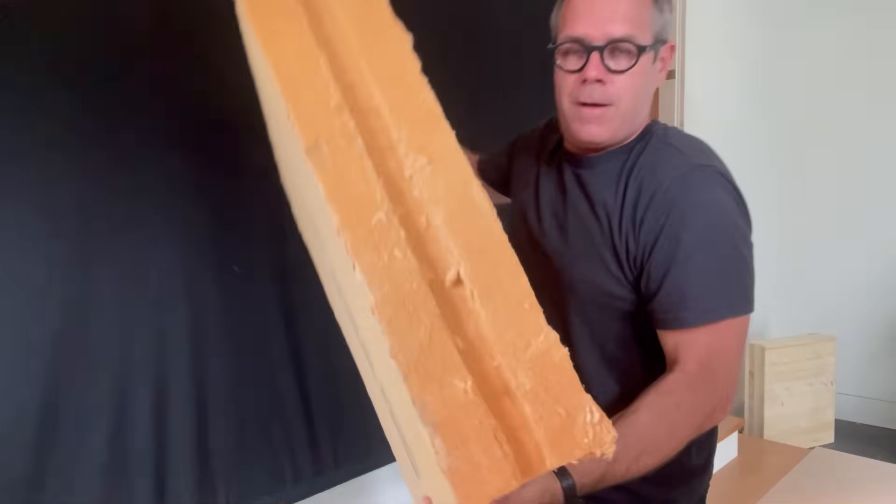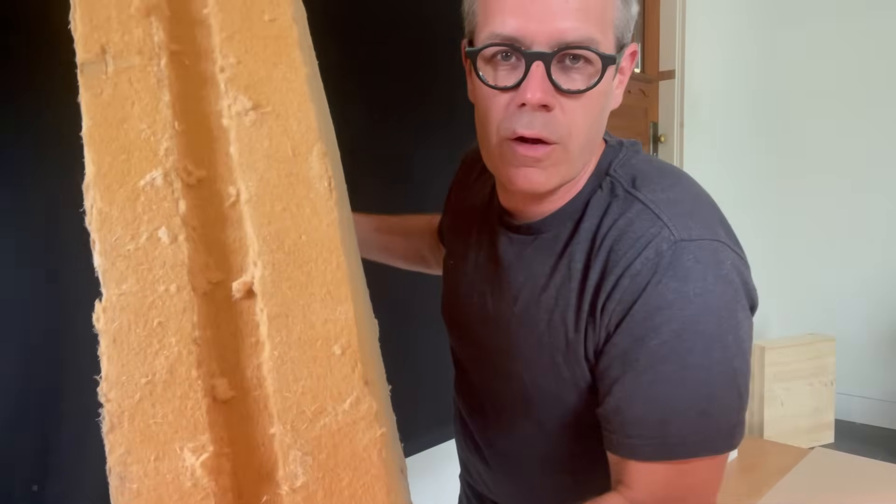You can also buy wood fiber board as a thin board — it looks just like MDF, but it's not MDF because it uses much longer cellulose fibers with less glue, which makes it vapor open. I actually used this underneath the floor deck of the building. It also comes in much thicker versions — this one here is 160mm, or just over six inches thick.